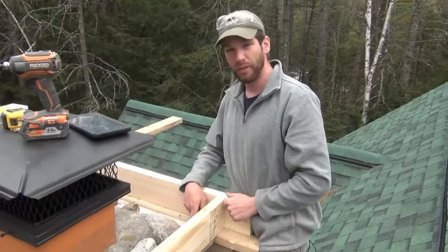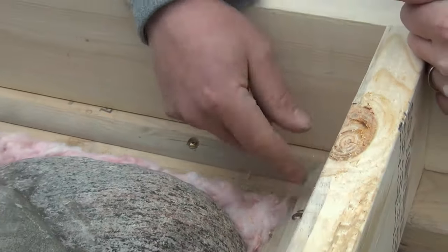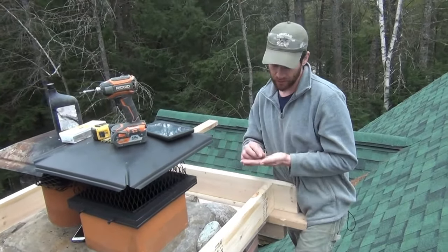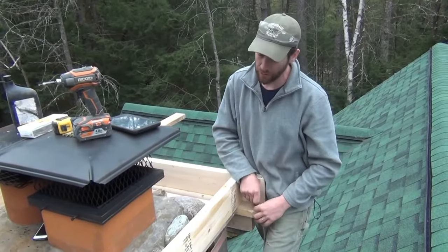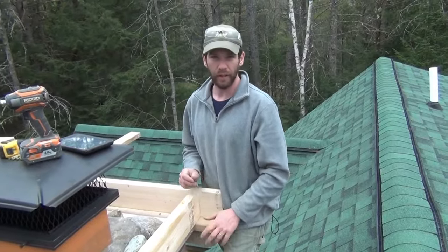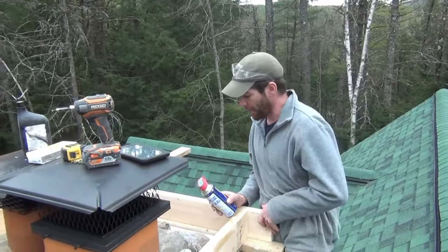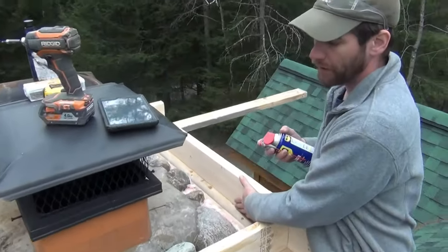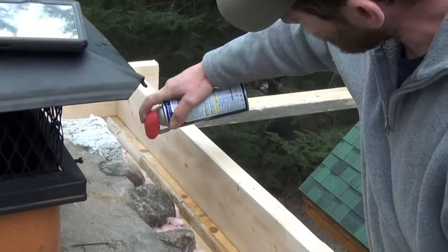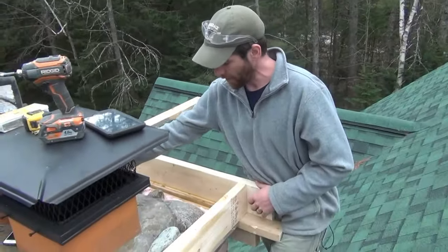We've got screws underneath where we can get to them. We did have to screw these corner beads, and one trick if you ever want to take those screws out: get a little bit of Vaseline or white grease — or peanut butter when I didn't have anything else — and put a dab on the screw head. That way when you put the concrete in, it doesn't fill your screw head and make it impossible to remove. Same thing for any exposed screw on a flat surface. Then for the form itself, the best release agent I've found is WD-40 — hit it all the way around the edges.